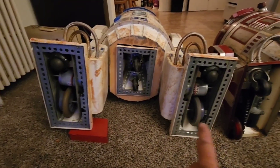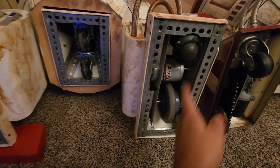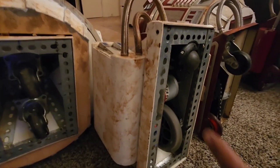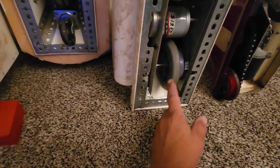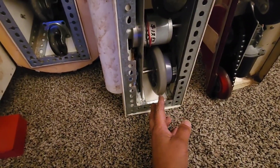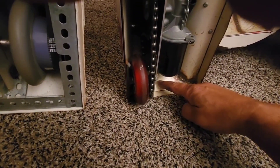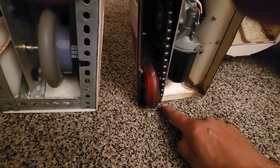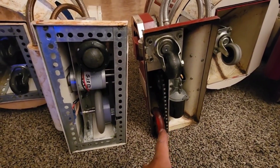But the stance here with this big giant wheel is only about 7½ inches, and that is not a very stable platform for R2 — touching the floor at only 7½ inches. The problem is I have this big giant wheel in there and because it almost wants to rub on the foot shell way up here, the wheel had to be placed much further in. So from the edge of the shell to floor contact it's like 4 inches, as opposed to this one being really close to the shell, way down here, where it's much wider — only about 2 inches from shell to floor contact. So on a custom drive with a tiny wheel, you get a much better stance.